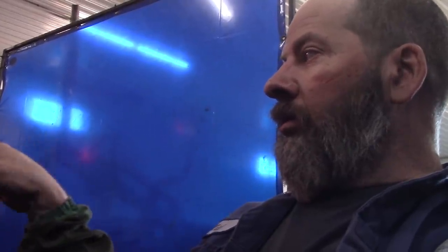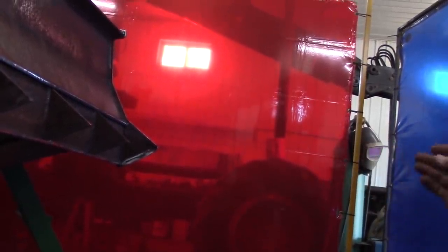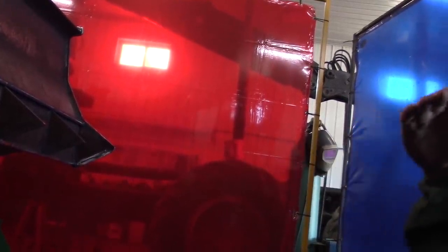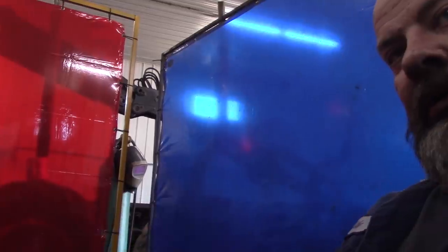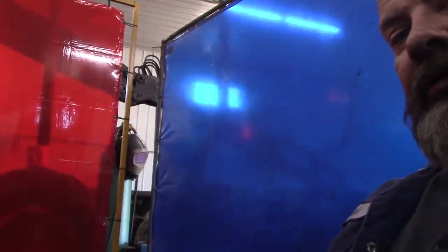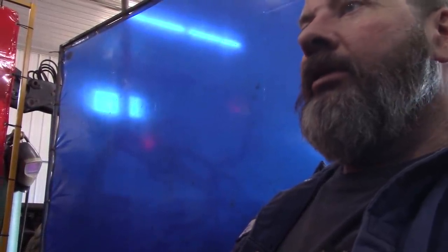So I'll eyeball it and then I'll get that plate cut to the right inside dimension. And it's 3/4, I know that. So on that corner, it's actually gonna protrude down, and so I'll have a nice weld on the outside and a really strong weld on the inside. What I'll probably do then is cut myself a sliver to remake that corner the way it's supposed to be, or I'll just single pass it with hardwire weld and build it back out so it looks original. I'm not just a scab-on-blade type guy. It's gonna look just like it should, relatively close. That's all you need to strengthen that corner. Well, you need the strength everywhere. It's a blade. So I'll bring you back later.